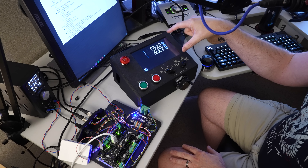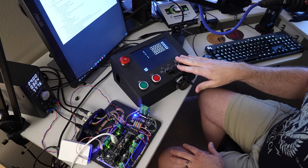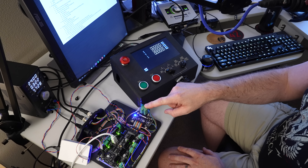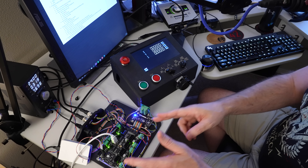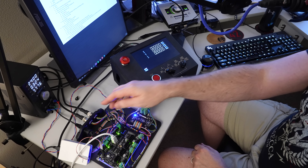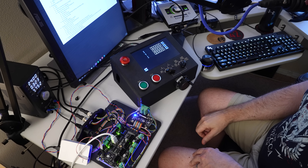This is just a basic control panel. I've got a 4D Systems 7-inch HMI here. I've got some mechanical controls and an MPG encoder for jogging the machine. The MPG encoder is wired up through an encoder adapter to the ClearCore, and the rest of the mechanical inputs are wired to the digital and analog inputs. The HMI is connected with a serial port, and there are some extra wires to provide extra power.